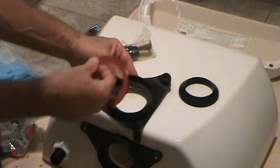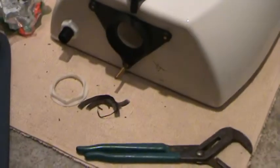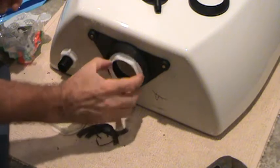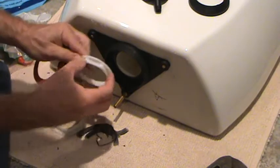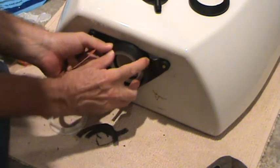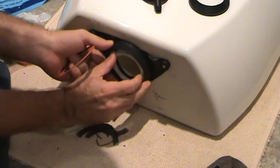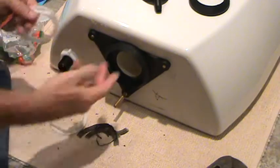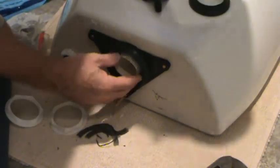If you don't have this washer, what happens is when you try to tighten this down without the washer, you can only get it so tight because now it's rubbing on this rubber gasket. When it gets tight, it wants to turn this gasket. See how it's puckering right there? I'm turning it and it's turning all the rubber, and it's not going to let me tighten this any tighter to pull this pipe through the hole. Do you follow me?